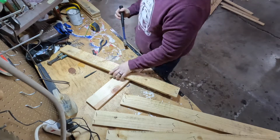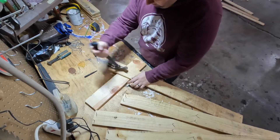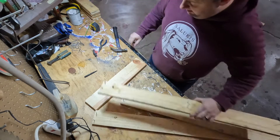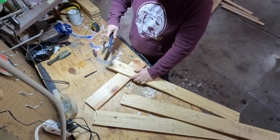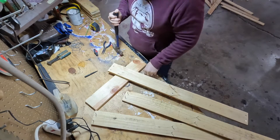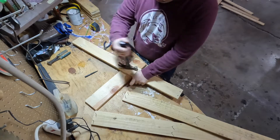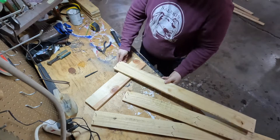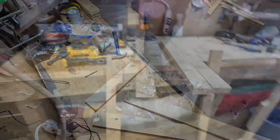I've also done pallet projects with very thick heavy oak pallet wood. With those ones, I have an electric wood planer that I've often used to plane down the boards after I cleaned them up. The very first time I did it, I made the mistake of not taking the staples and nails all out, and I chewed up and destroyed blades very quickly — not to mention it was, I'm sure, a safety hazard. Those oak pallets planed down make a very nice, clean, quality-looking piece of wood that you'd never know came off of a pallet.